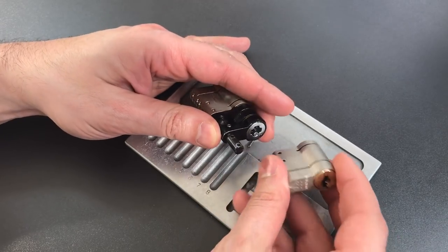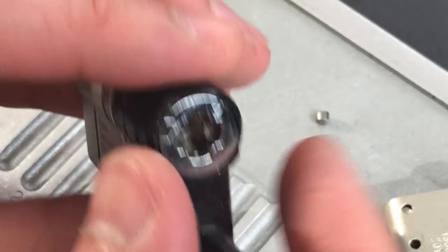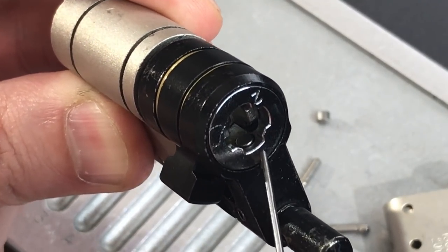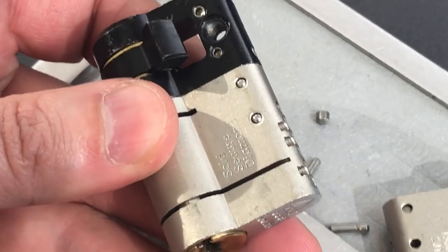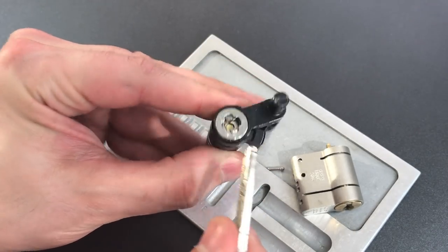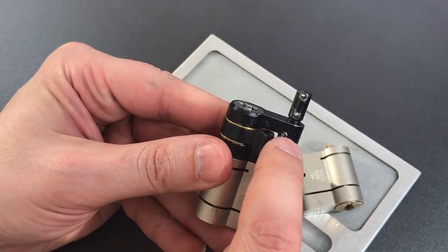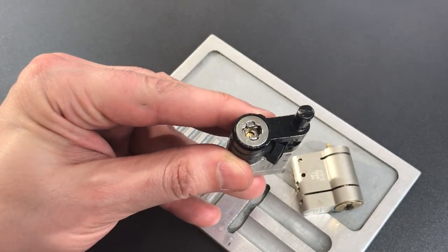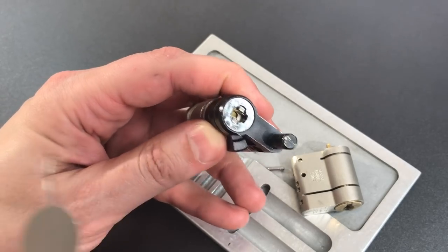We'll pull this off. I just heard a nice loud click, and what happened was a tiny little pin right here just shot down and locked the cam from this side. It can still be operated from the other side — let me show you that with the key. We can still operate it from this side; however, the cam cannot be turned at all from the other side. The only way you can reset that is by removing the little allen pin right here, and then there's a little detent behind it. You have to take that screw out, allow the detent out, and then you'll be able to push that pin back up. But as it sits right now, there is no way to get that all the way back up.